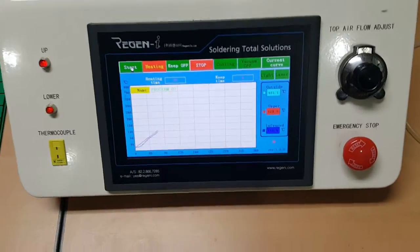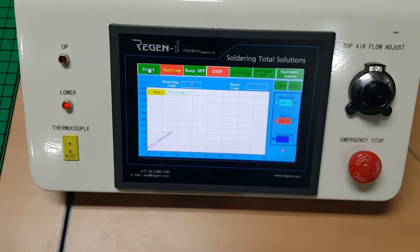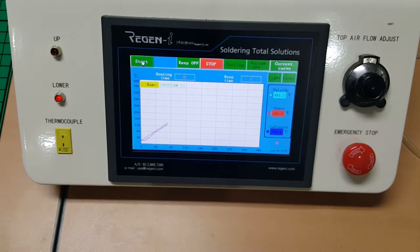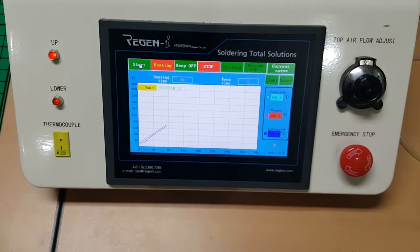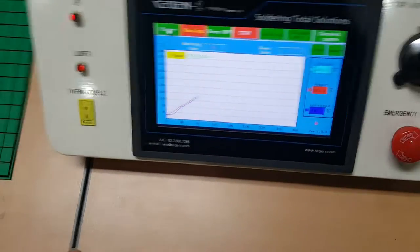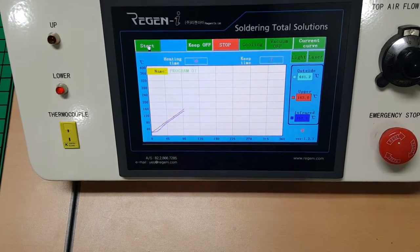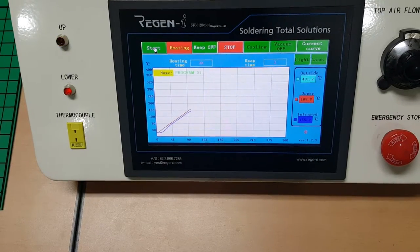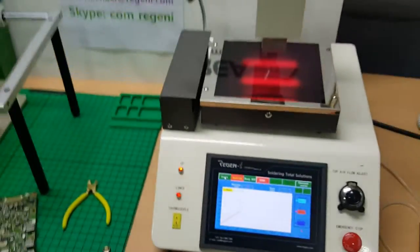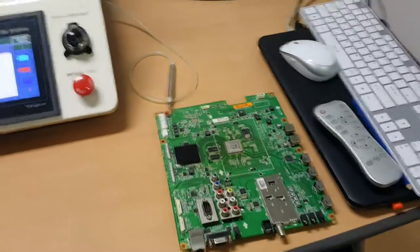And a cooling button. Cooling is automatically processed after heating, but after cooling, if the temperature is still high, like more than 50 or 40 Celsius degrees, you simply click the cooling button to make the temperature lower than 50 Celsius degrees, and then you can desolder another chip. So this BGA Rework machine is to be used to desolder or solder any targeted chip.